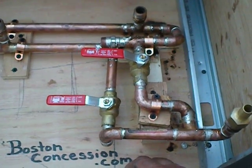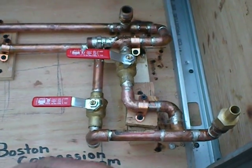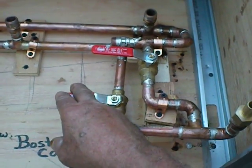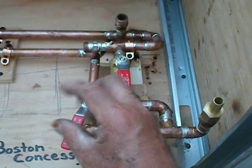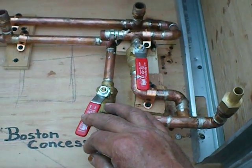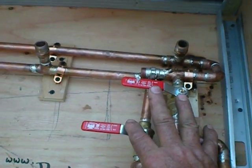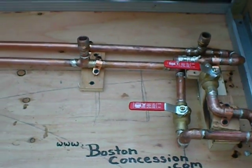And in climates that'll get cold overnight, you will run your sinks into your waste tank, which you will drain, and therefore emptying all the water. Then you will open up these two ports, and you'll just allow everything gravity fed to drain out of all your pumps and your water heater, etc. This will protect your lines. So this is a really important feature. You don't want to have to heat a unit all winter long.